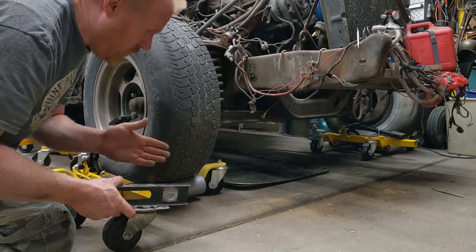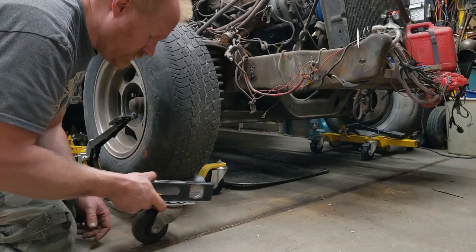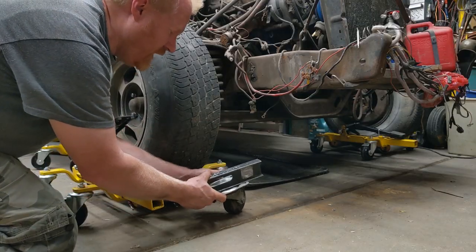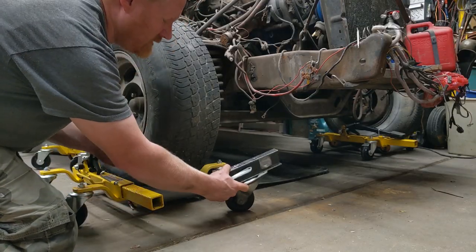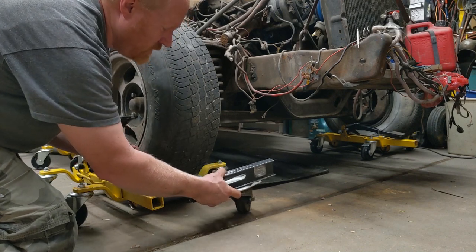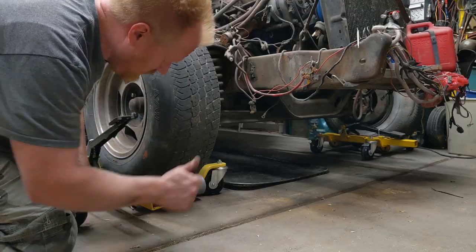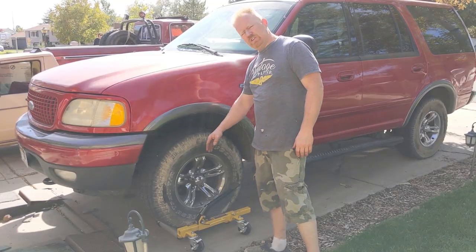And so when you're going side to side, this one's just fine and happy going this direction, and this one over here is fine and happy going that direction, but it wants to flop and has to climb up, and going forward, never really wants to go forward. So having these perfectly parallel is ideal. Fully modified, the wheels don't sag at all.